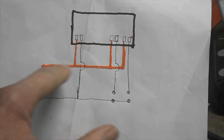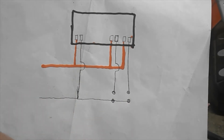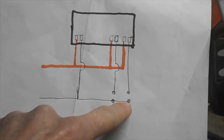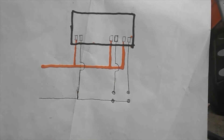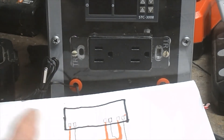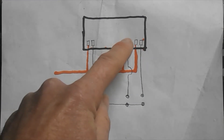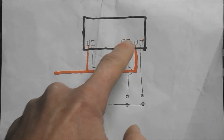My power lead also goes over to one side of these output relay ports, so two sides go there. The other side of my power goes to one side of the outlet, and the output ports of these two relay points are just dead-ended here. So this is my plug — one side's hot, one side's not. When the relay kicks on it completes the circuit so power can travel through the wiring. I didn't know that originally — I just took my two leads up here and it did not work, so just to let you know, you need a power source to these points.